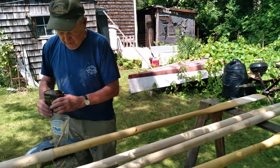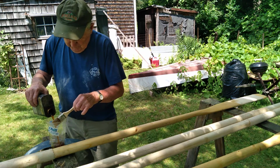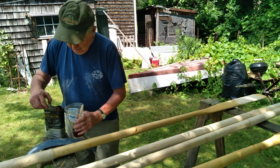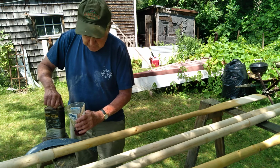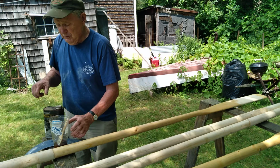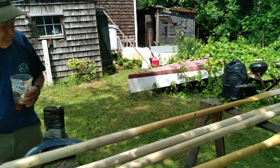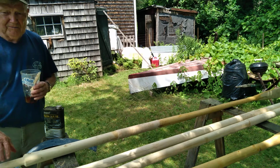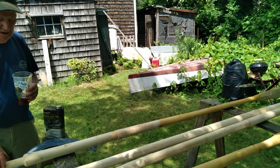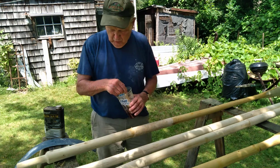Our rowing club oars were, after a dozen years, just as dark as could be. And of course that preserves the wood. Well, one thing I never do, don't put anything on the handle. Your sweat will preserve this wood. It feels a lot better if it has no finish on it, just the plain old wood.